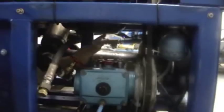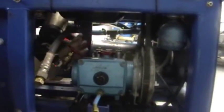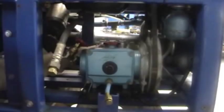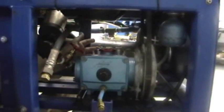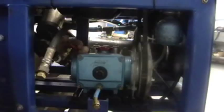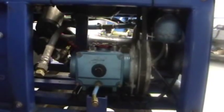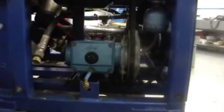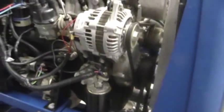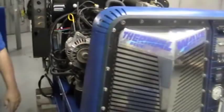The pump is really simplified. It had two switches on top and a lot more devices, including a chemical injection head that's been removed. Everything's completely off this pump except the cold water inlet, the high pressure out, and the pump now pumps cold water. We actually use the pump to draw the chemical like we do on our TNT designs — we've never used any injection pumps.